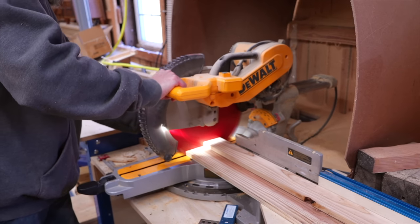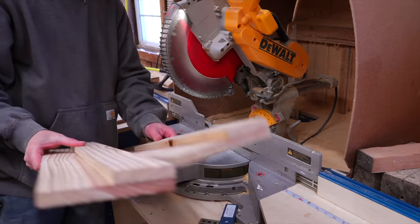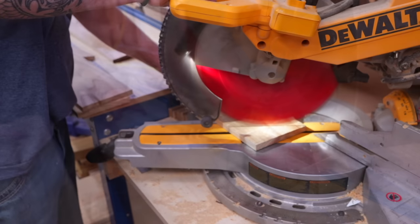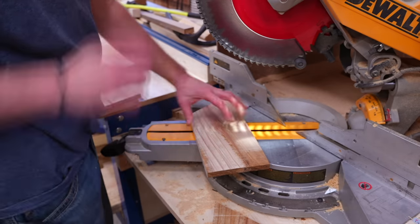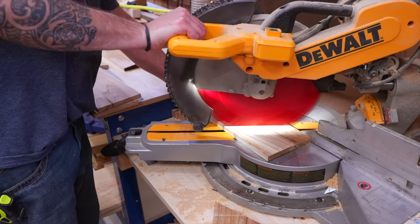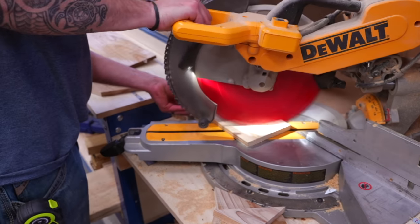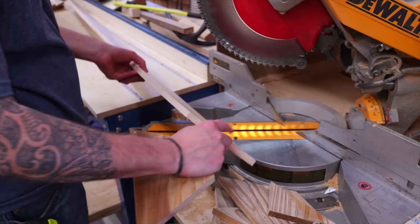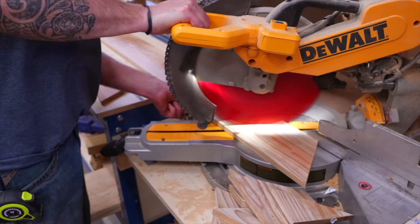Now I'm going to cut parts A and B, which are going to be for the walls of my boxes. I decided to cut those stacked so that they would be the exact same length. Now let's cut part C, which is the upper part of our end boards. They measure 10 and three-quarters across the top, and all of our angles are at that same 35 degrees. The easiest way to do this is to make your first 35 degree cut, flip the board, and make another 35 degree cut.